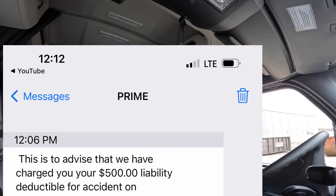So that will be coming out of my check as a lease driver. This is just for people out there, like I said, I'm not perfect. Clear situation of, I should have checked. One, I should have checked to make sure the pump was spinning in the correct direction. And two, I should have asked the customer if they had a check valve. So even if it was reversed and they had a check valve, it would not be able to suck any product back from the customer.